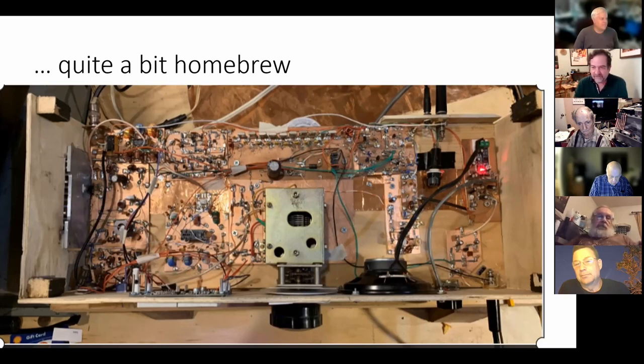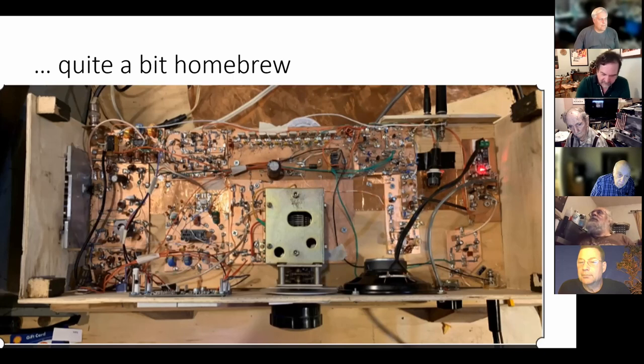It's a bit hit and miss, but when I built my BitX 20 transceiver, I wanted to build it completely analog, completely chip free. So I built a VFO in there, and that's a VFO. Now a halfway house that you could do when you're getting started, and this is something that Doug DeMaw always recommended, was a VXO. Get a crystal, and then use a coil and a cap in series with the crystal to move it.